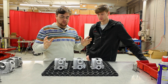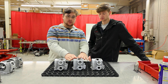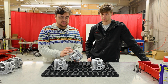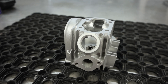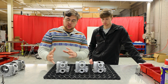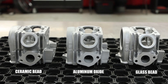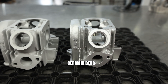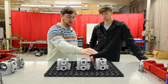We're back with results. Starting with ceramic bead — it looks phenomenal, almost pristine. In the middle we've got 220 aluminum oxide, which easily stripped off all the dirt, all the grime, and there was some paint and carbon buildup right in the little corners. Last but not least we've got the always reliable glass bead. Comparing glass bead and ceramic — ceramic is a finer abrasive and the shine and aesthetic looks phenomenal. But all three have done incredible jobs cleaning and polishing. The aluminum oxide gives more of a matte finish, while ceramic or glass bead give you a nicer shiny aesthetic.